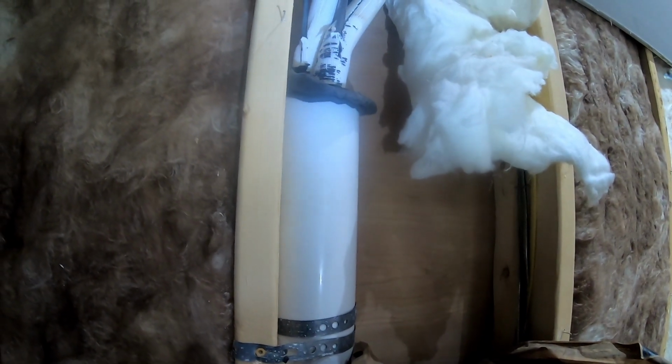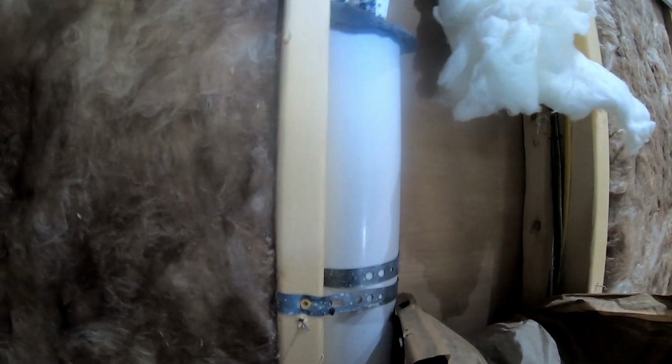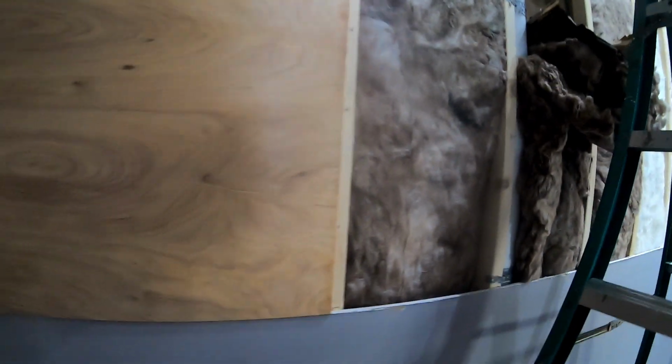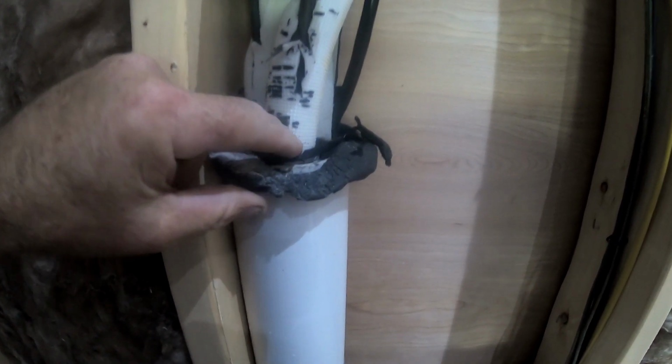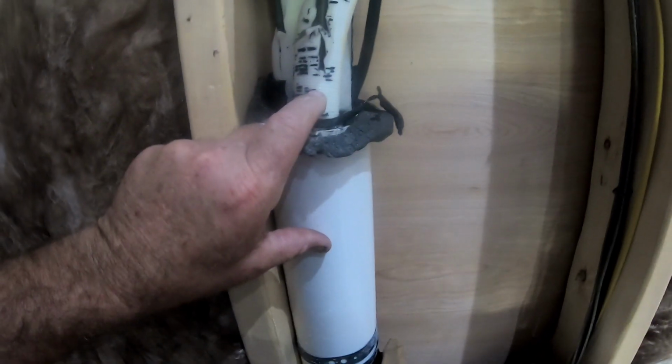At the point, I'm going to guess in October, we really didn't need it. This one 6,000 BTU in our master, if we leave the door open, cools and pulls moisture out of the whole house. Realistically, if we didn't have all these walls when we were building, it did just that. To cut all that insulation up. See, I had it insulated down here, duct sealed, then insulated. I insulated the line set, then before I did the outside, pulled my length back out so that I've got, you know, tape wrap this, at least 5 or 6 inches into the 3-inch.